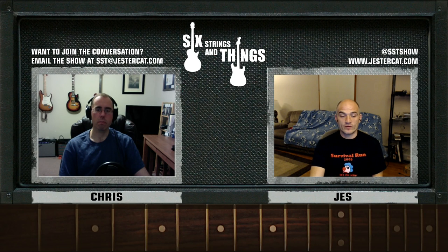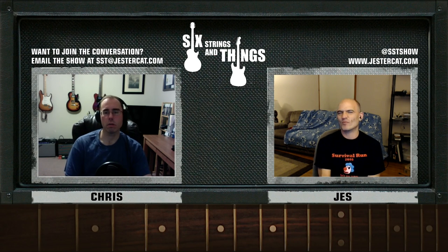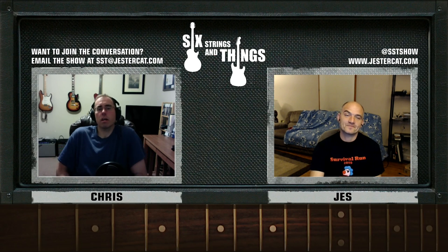There are pickups that have asymmetrical winds — DiMarzio had a patent on this. Pickups like the Steve Special and Mega Drive have coils that are not the same. Different resonances give you a wider range sound instead of that mid-range hump. I have a Steve Special and the coils are really different — you can look at it and one is packed with wire and the other is almost not really even there. When you split to the big one, it's a really nice, thick, full sound — almost a full Strat single-coil sound. The other one is just useless for that.